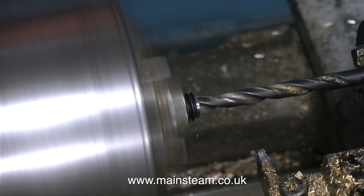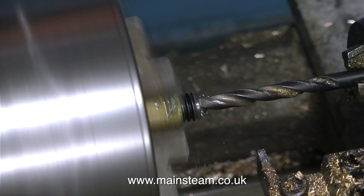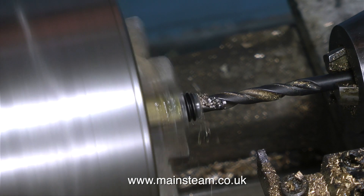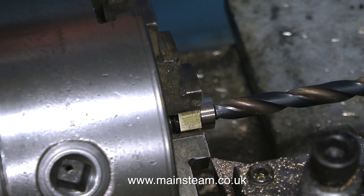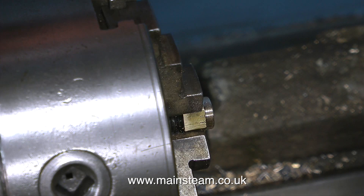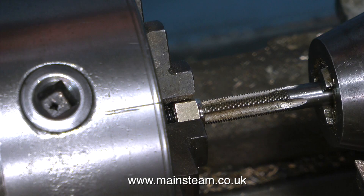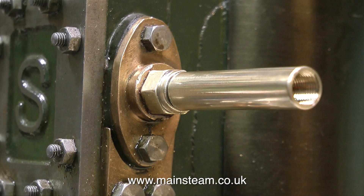I continued drilling with a 7/32nds of an inch twist drill, going through both the bolt and the brass. I then turned the part round in the chuck and machined the other end down to 3/8 of an inch. I drilled down the middle of the brass part only, cleaned and filed the end, then threaded that section 5/16ths by 32 threads per inch — a very common model engineering thread. On one of the pipes I also drilled and threaded the other end 5/16ths by 32.